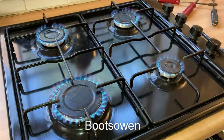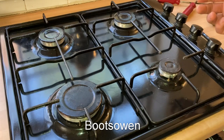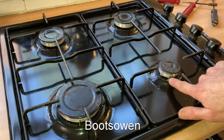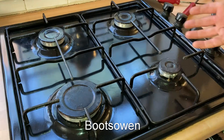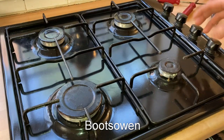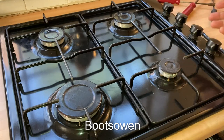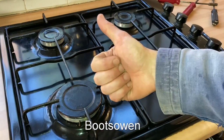And the last thing to check is the fail-safes. I'll turn all of these off — we should hear four clunks in a few seconds. One, two, three, four — that's it, so that's the fail-safes working. That's these little thermocouples here that stick up outside the gas ring. They get hot when they're in the flame, and that keeps the gas jet on when you release the pressure off this button. Some really old cookers won't have that, and if you just leave it on the gas will keep coming out. With these, the gas has to be burning when it's coming out, otherwise it'll turn off automatically. We were just checking that it is turning off automatically. Questions or comments, leave them below — thanks for watching, see you later.